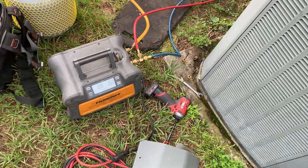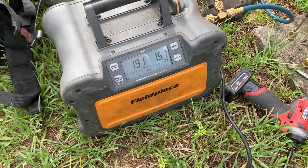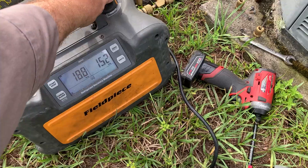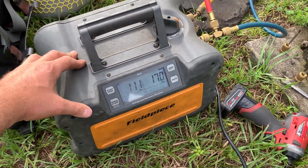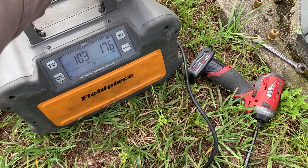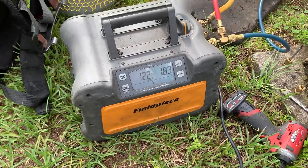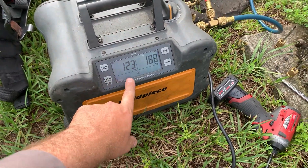You can see I'm pushing gas through here. Now as you see your pressure in your tank and your input start to equalize, if you have a recovery machine that can be throttled — I had that backwards with the pressure, so I wouldn't have been moving much gas — but we got that nice sub-cooled liquid pushing into the machine to the input.